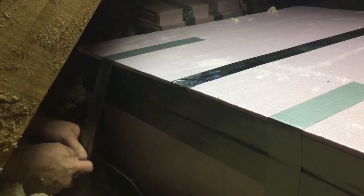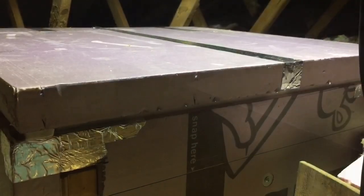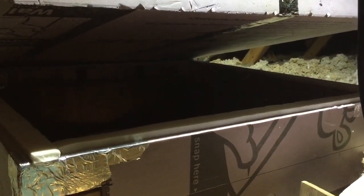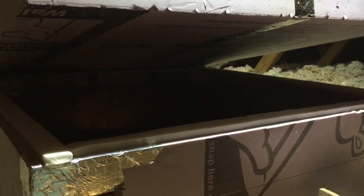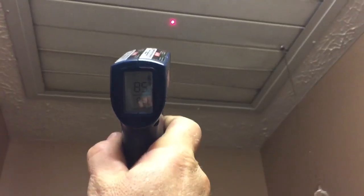Once that's done, check for fit, make sure everything's sealed off, push the tape down real good, then go downstairs and turn the fan on to try it out. With the fan on, the insulating cover goes up. Once you turn the fan off, it's sealed back up. A quick temperature check shows the mid 80s — I've achieved what I'm looking for. This is how you make an attic fan insulation cover. I'm HowToBob, thanks for watching.